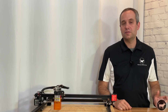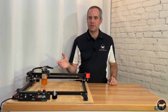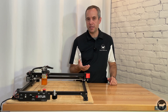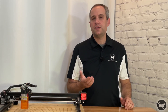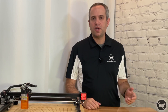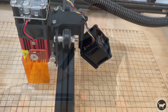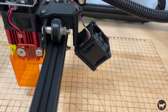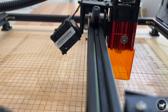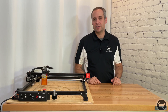You can check the links in the description to download those for free. The next thing I really wanted to try was adding some sort of laser air assist. The reason you want that is to remove smoke and debris from the beam so it's not interfering with the laser. I've seen other mods using fish tank air pumps with tubes directing air to where you need it. My approach is simpler — I bought a 12-volt server fan and designed a 3D print that attaches to the top of the laser mount, hangs behind the X axis, and blows a substantial amount of air directly at the laser beam. I added the wires in a loom with the laser wire and zip tied it to the drag chain. You just plug it into a power outlet and the fan really takes off — it seems to do a great job as an air assist. You can find the STL link and the fan I'm using in the video description.